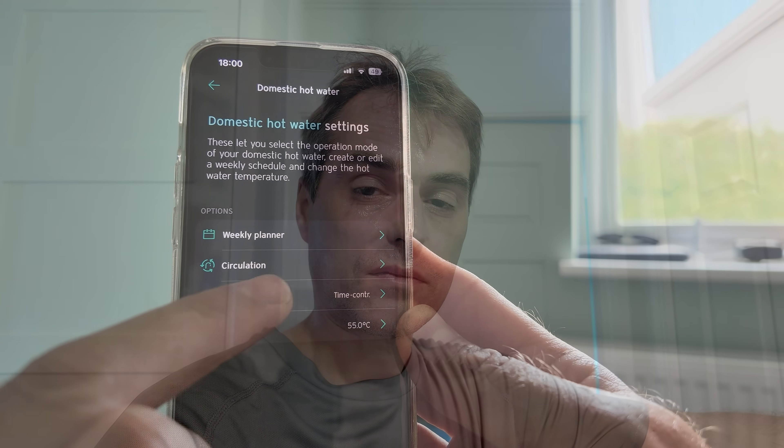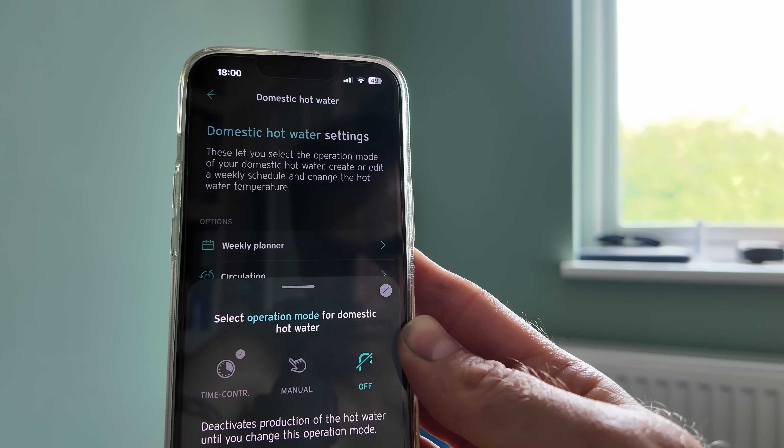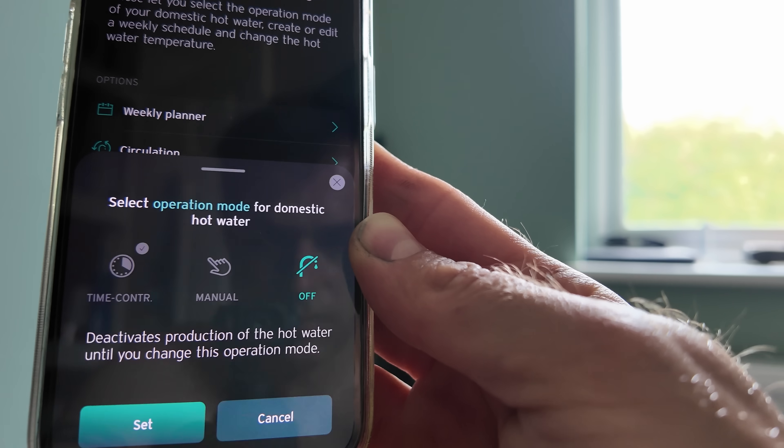Another 5km run today on the hottest day of the year — 31 degrees outside. I'm now going to run the most brutal test: I'm turning the heat pump off completely, just to see how long the energy stored in 60 litres of water can give me around 5 to 6 litres per minute of comfortable showering. I don't mind if it goes cold — it's probably going to be really nice if it does. The idea is that in winter we'll keep the store at a hotter temperature to bridge the defrost. Right now the store is at 55 degrees with the heat pump off.